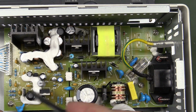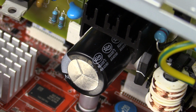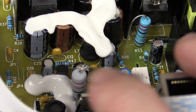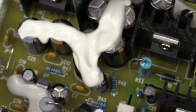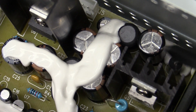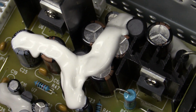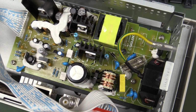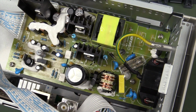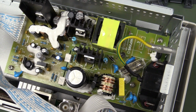They've elastic all the caps down. Lelon caps, yeah. Not exactly Panasonics. And you might not be able to see it, but they have gone for Lelons pretty much everywhere else as well. They look like the Gold Series ones. They're probably low ESR jobs, so at least they're stuck with the one manufacturer. But you know, this is a bottom of the range, scraping the barrel, $350 odd retail scope, so that's a pass. At least it's neat and tidy.